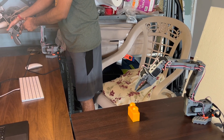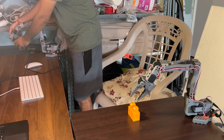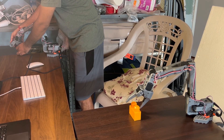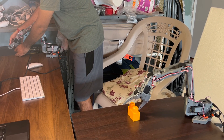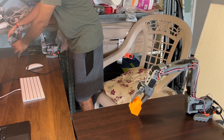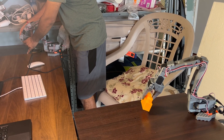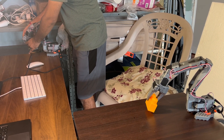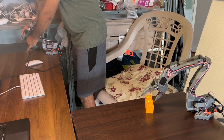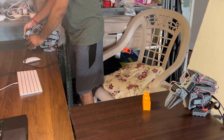The follower arm, our SO101, mirrors the movement live in real time. Every action — each joint angle, gripper state, and timestamp — is continuously logged to create a trajectory. This single demonstration is called an episode, and we'll record several of them to build a dataset. Each episode becomes a miniature example for the model to imitate later during training. The smoother and more consistent my motions are, the easier it will be for the ACT policy to learn precise and repeatable control. After a few recordings, we'll have a dataset of image frames and robot states ready for fine-tuning.